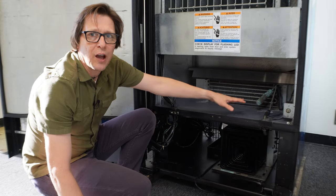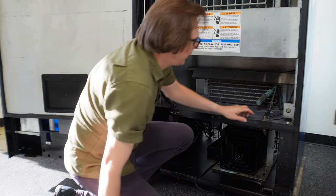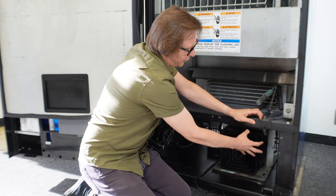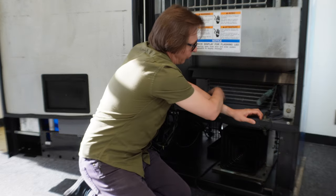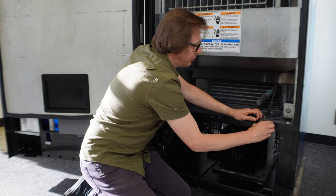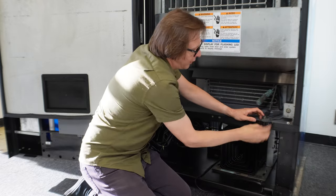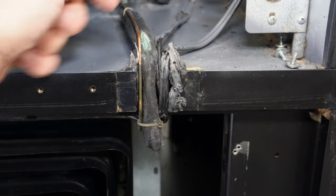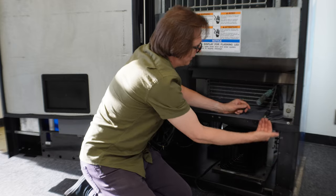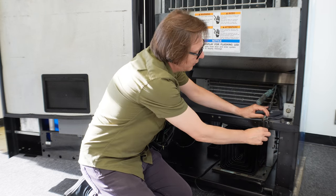Once that's removed, I like to remove this gateway or keyway right here. We have the refrigerant lines coming from the bottom of the compressor or condenser up into the evaporator coil — both high-side and low-side lines. This little metal bracket is held on by two little latches, and I just popped it loose. That gives us access to the gateway. I'm going to pull off the plumber's putty — it's kind of like Play-Doh. This putty prevents any air from getting into the cold box, which would make the compressor run longer than needed, or maybe freeze up the coil.